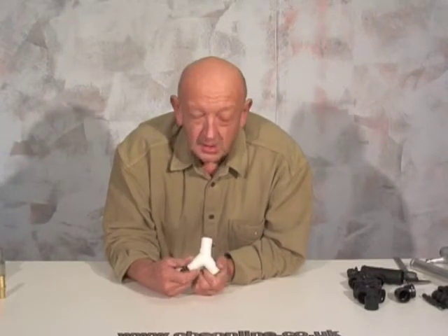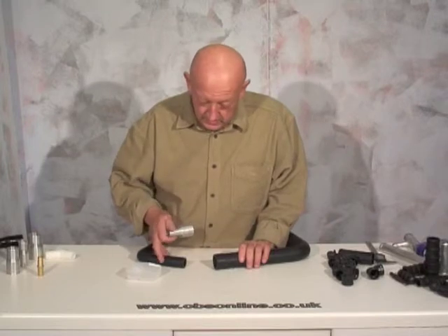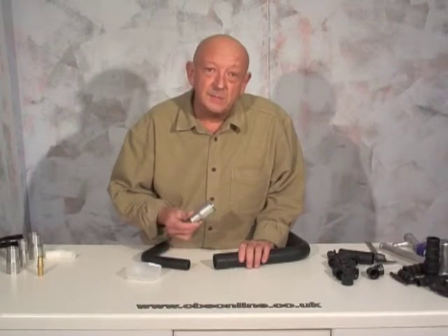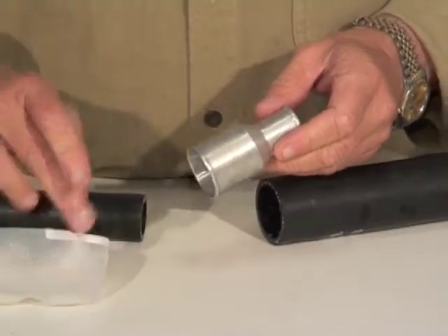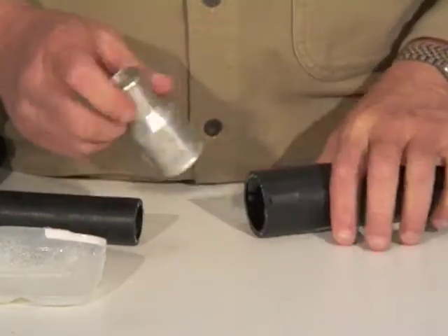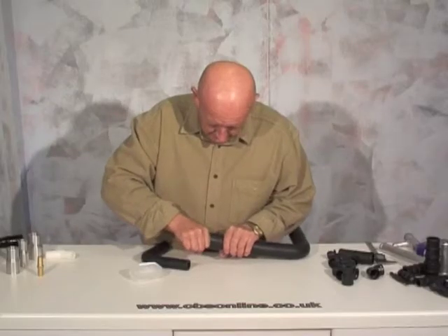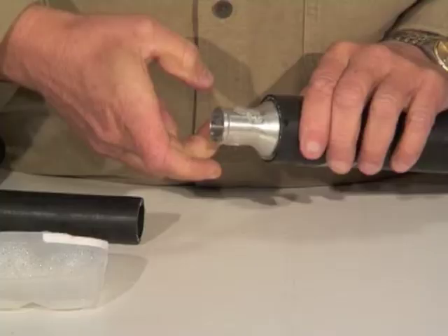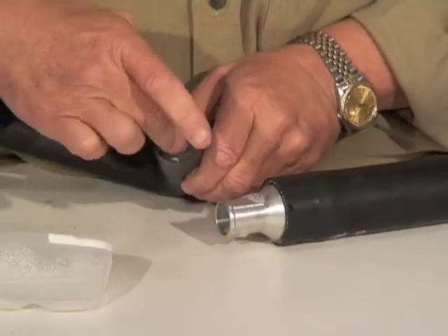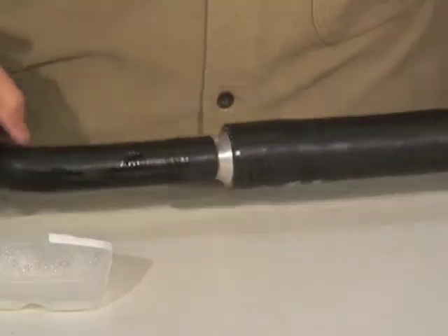There's also a range of moulded nylon T's from 6mm to 19mm. I'm going to join this 38mm elbow to this 25mm elbow with a stepped aluminium joiner. Always use a little bit of soapy water on the joiner and inside the hose — it just makes it go together a bit easier. Slide the joiner into the hose; you can put your jubilee clip around it if you want. Then do the other one and slide that on — they've got retaining lips as well to stop it pulling apart.